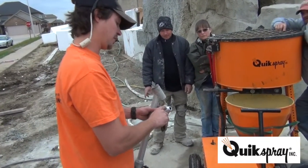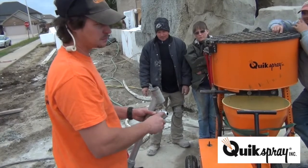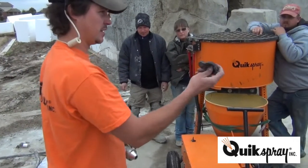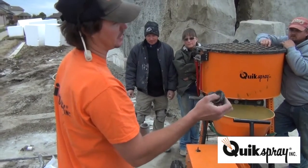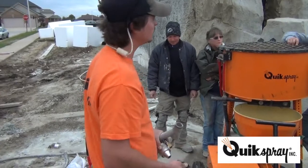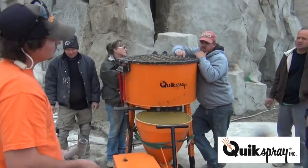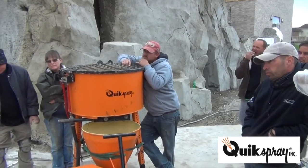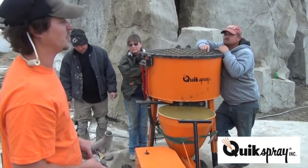But something like this would be better. This will not blow off. It'll give you a better spray pattern. This is in case you're working in, especially, the fireproofing industry, where if they do get a plug, they can just rip it off real quick. Okay, I got you. Pop it out, slap it back on. Isn't the benefit of it blowing off also safety, because you don't create back pressure on your pipe? Right, you don't create back pressure, and you might not develop a problem up here in the pumping system or in your material lines.